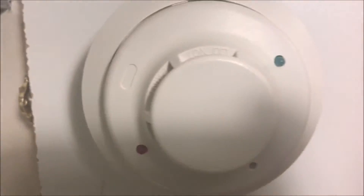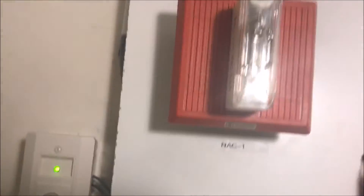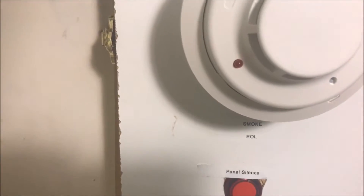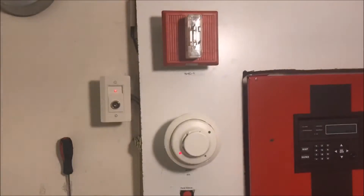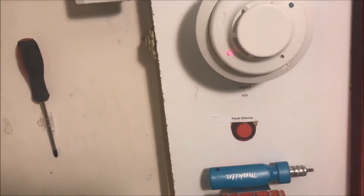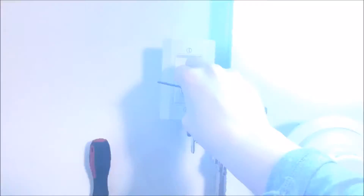So now we're going to get to some of the testing. We will do a test button, we will solo test it, and we will test it with some actual fire. I'm just going to be using this little hex wrench, and my Radionics alarm will be going off at high tone code 3. All I have to do is press the button.